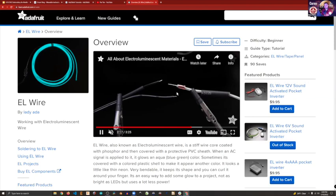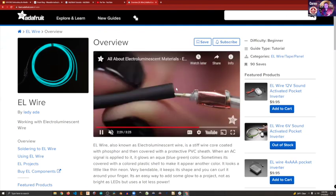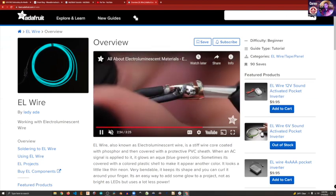I've done a project where I solder a lot of EL wire, and every one of these solder joints, I just want to say they're all spots where things can go wrong. So if you're going to use EL wire in a project, try and have the least amount of junctions you can, is my genuine advice, because as cool as it is to have discontinuous pieces, they all become failure points.